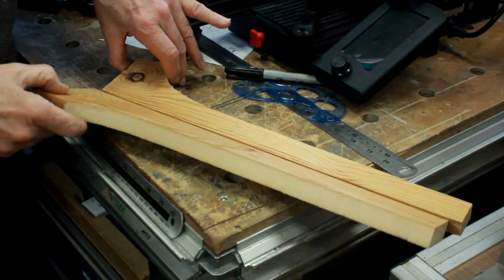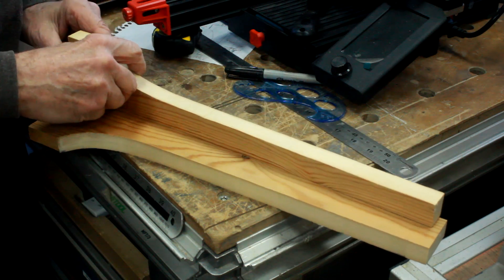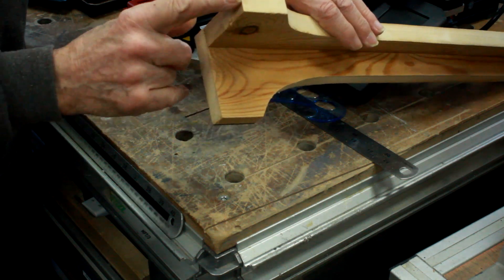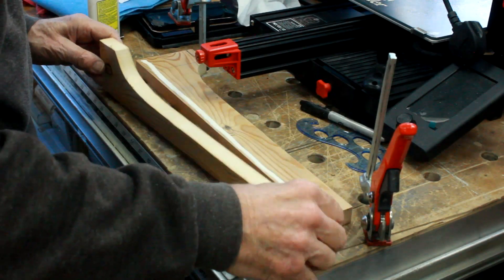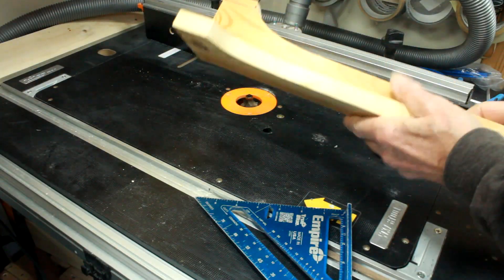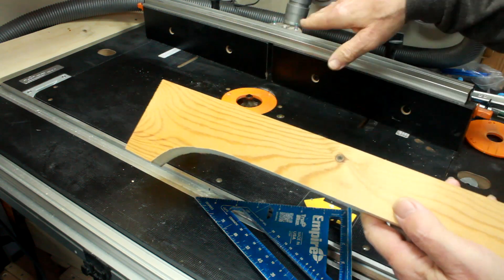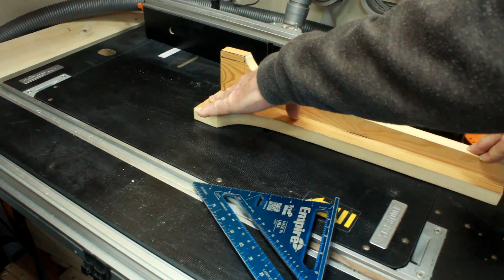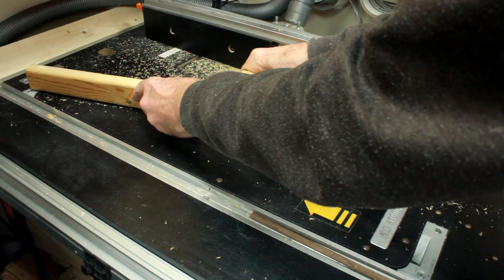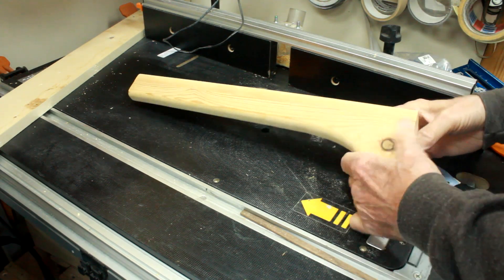That's got me two pieces of wood to the same shape, but one of them is narrower than the other. The reason is that it will be glued onto the other piece — I don't think it needs more than glue — and that will make my leg, which is the same dimension when you glue it up. That's just come out from being glued up after resting overnight. I'm going to run around some of these edges with the round over bit, and that's got me the shape that I want.